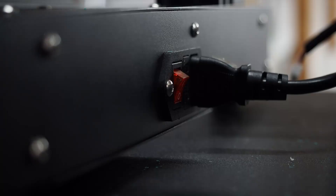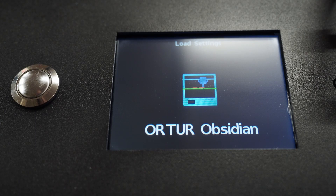When you take a look at this printer, there are some pretty strange features that need a little explanation. For example, when you try to turn on the power, nothing happens. This is actually the first very good thing I like about this printer — you have to push a second power button to operate a relay, and that relay turns on the printer. The relay can also be used to turn off the printer, so if you put the right G-code command in your end G-code, the printer can turn off automatically.